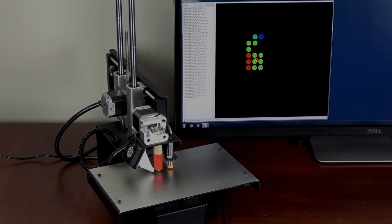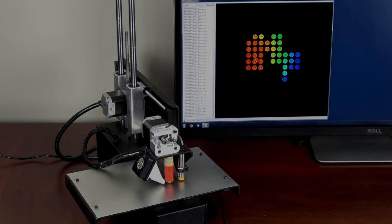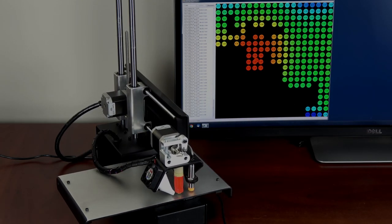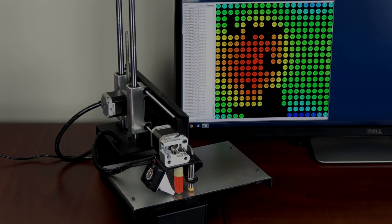I wanted a clearer picture, so I added a pattern tool to my inspection utility. You can pick how many points you want in the grid, and it charts out just how warped things are. The result was colorful. The difference between the highest and lowest point was three full print layers at 0.1 millimeter layer height.